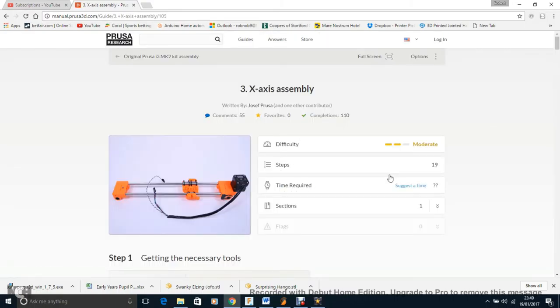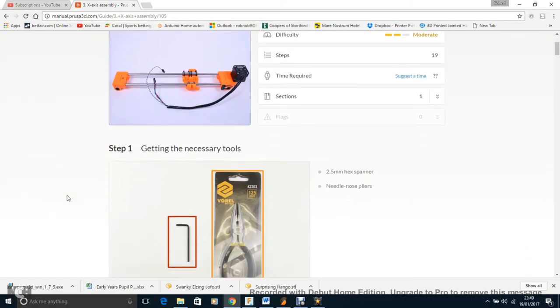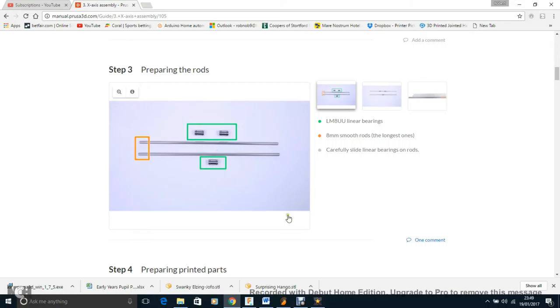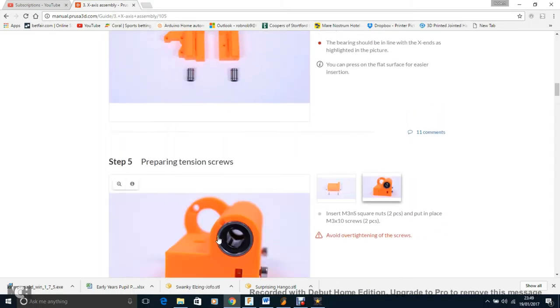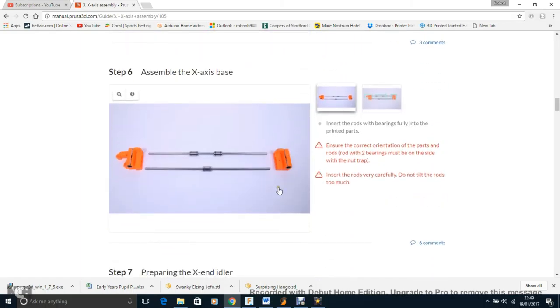On to the X-axis — a much quicker process with only 19 steps compared to about 39 for the Y-axis, and only three printed parts. You'll have the longest rods and some more bearings. Start by seating the bearings — that's easy. For step five, note there's a little gap for the bearings, so don't be afraid to push them in if they're tight — the printed part will flex just a tiny bit to let them in. Getting the rods in can be a little awkward for some people; you may need a small wooden mallet to tap them into place.